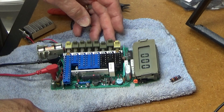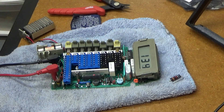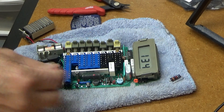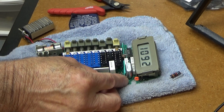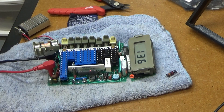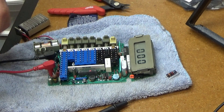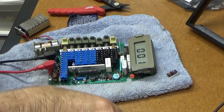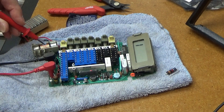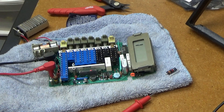I'll go take a look — it may have a bad capacitor or something giving that high reading. Now it needs some calibration, but at least it's measuring everything now. I did have to replace one of the fuses, and it's measuring zero ohms going through the fuses, so they're both good. So we're getting there.